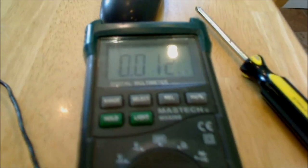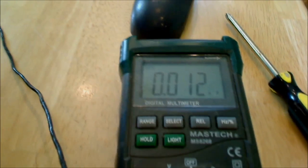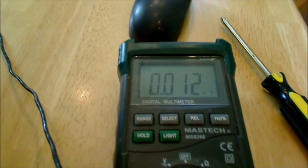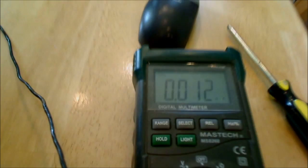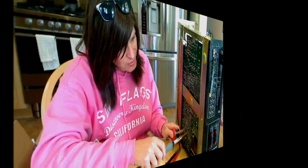We'll put it on the meter to see if we get any kind of reading at all. Hopefully we should get some voltage through there. If we get a zero reading it means we've got a bad resistor and we're going to have to replace it. But they're very common — I have a ton of them in my parts supply box. This is a little more than usual replacing fuses and stuff, so let's keep our fingers crossed.